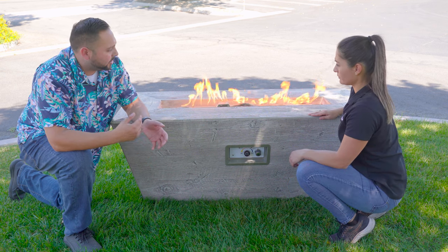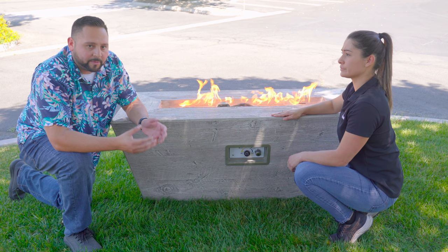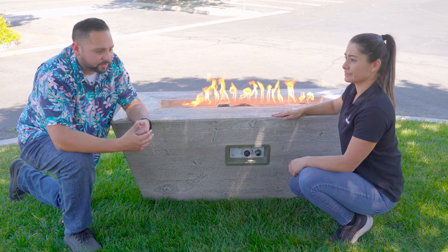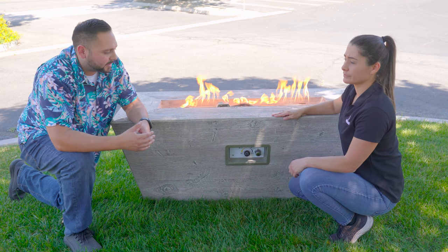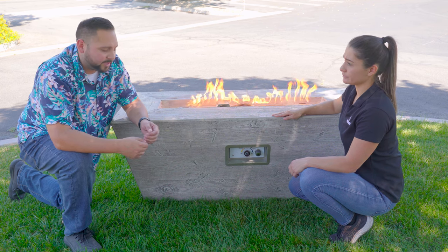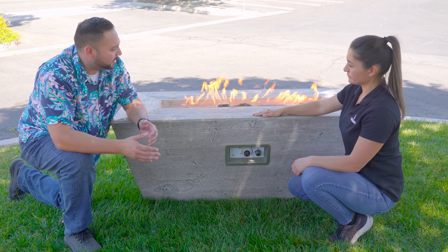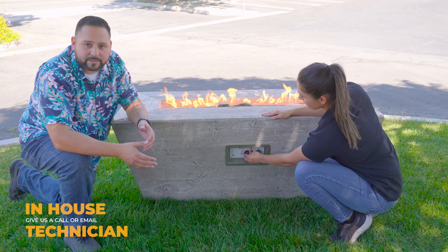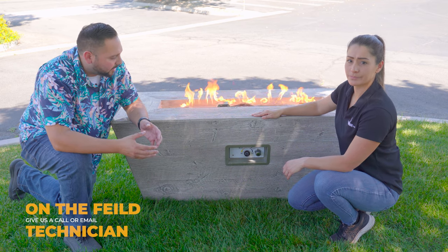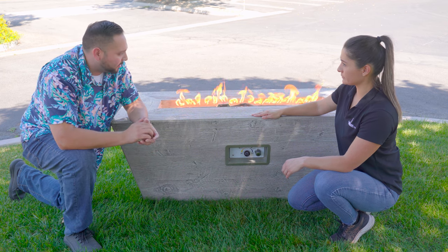Once you use it and let's say you shut it off and you want to turn it back on, it'll light up right away because the thermocouple has been warmed up from the previous use. You just have to run through those first couple steps when it's in storage or you haven't used it for weeks or months because the thermocouples are cold. So that's the key trick — just heat up the thermocouple and from there it'll turn on right away. That's how you use a spark igniter flame sense ignition system. Remember, if you guys have any questions or concerns, call us or email us. We have sales reps on the field that are more than willing to help you guys out. We hope this video was a useful tool for you and we look forward to helping you guys out more.